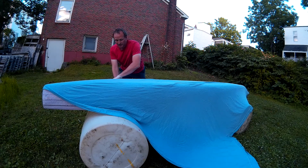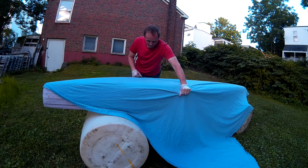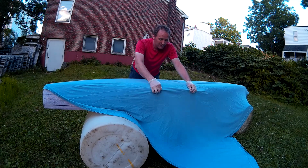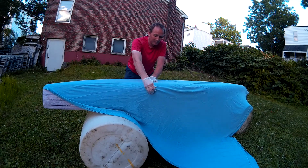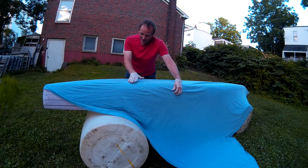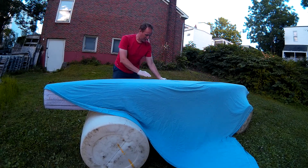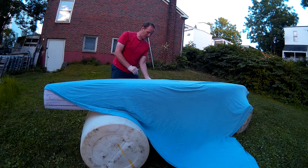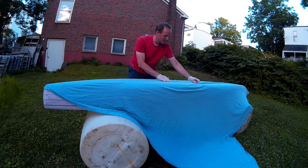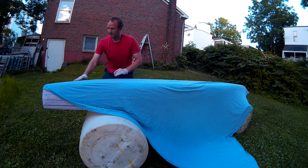Because remember, you are getting it wet. When you get a natural fiber wet, it will stretch a little. So, work that through. Work out your wrinkles, however you have to do it. It's a nice thing. Some people want to talk about thinning the glue. I tried that once. I was very unhappy with it, and I will never try it again, because all that extra water takes longer to cure. And the stickiness of the glue is what allows you to go faster. If it's really wet, you got to keep going back and doing this with the wrinkles a lot more.